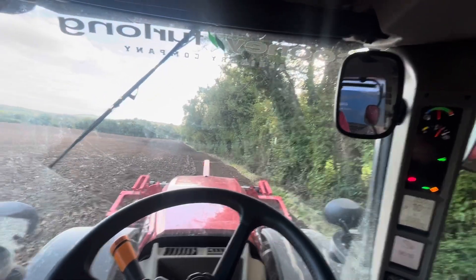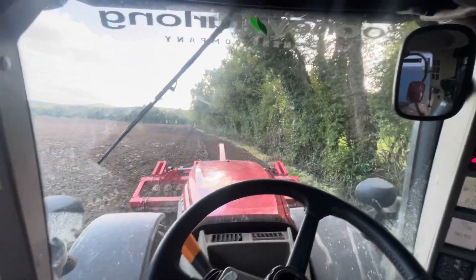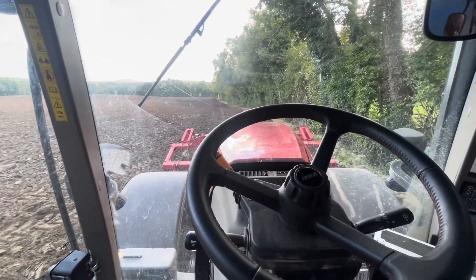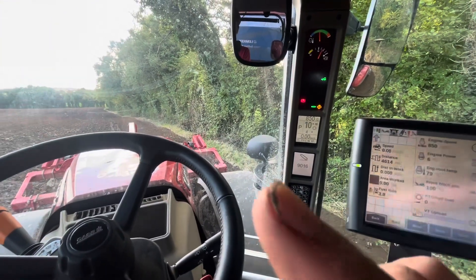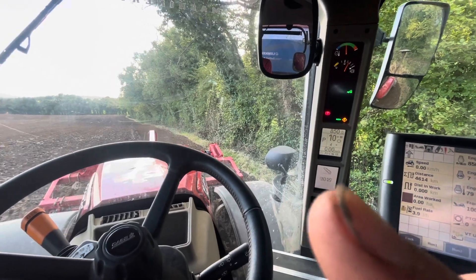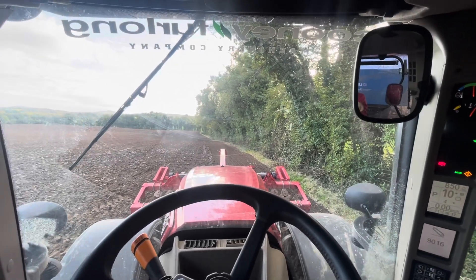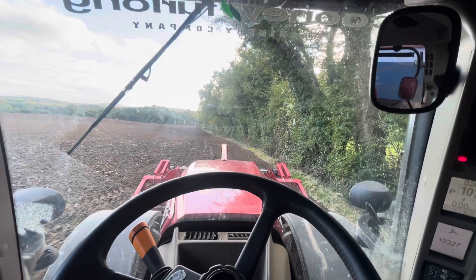The reason we're sowing with this and not the 6490 is because the front links on the 6490 won't lift fast enough. It'll lift, but after an hour or so the oil gets hot and it just won't lift the front. So it's not quite big enough, but we'll sow away with this for a while. There's an error code showing up — it's just a little wire on the front for the buttons controlling the front links that got pulled somehow. They've ordered a new one and said it'll be out Monday — today's Friday — so I'm going to go sow a bit.